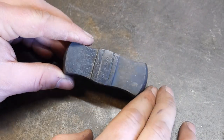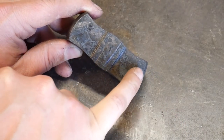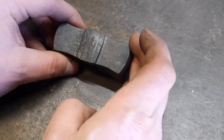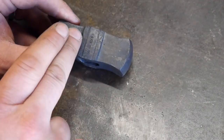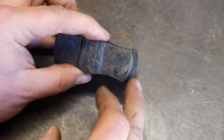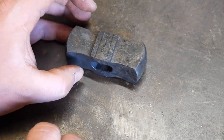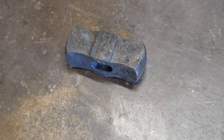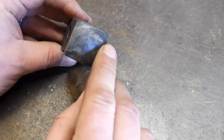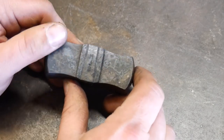Here we are. This is now hard steel. Take a look at the surface pattern — if you see these really gray areas, what that is supposed to be is martensite formation. I am not a metallurgist, so take what I say with a grain of salt, but this is the most commonly accepted explanation I've been told. Martensite formation is a good indication of hardness — it means you have successfully hardened this piece of steel. You can always check it with a file. I already know it's hard from the way it looks — it's very gray in color with a good martensite formation on the surface.